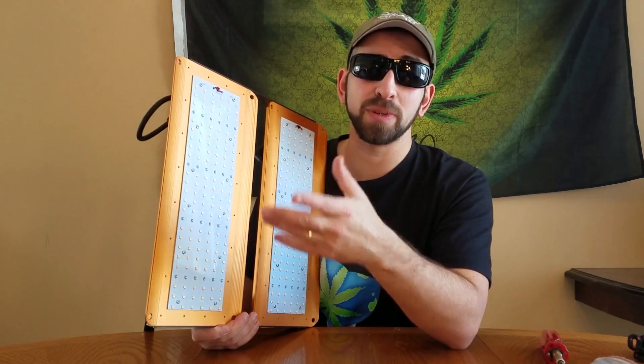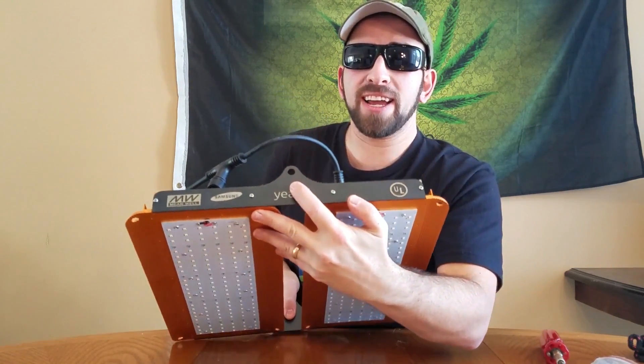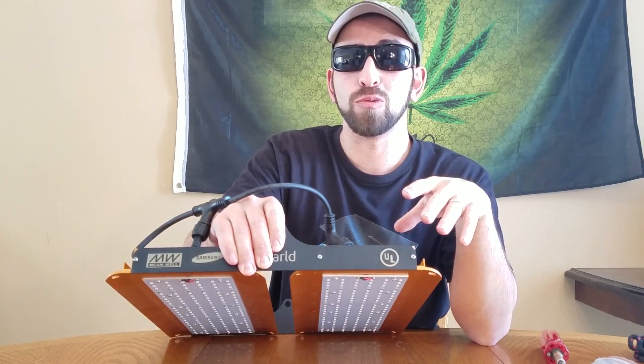This light is UL certified — they even have it right here on this bracket: UL. It's UL 8800 certified, which means it's designed for commercial grow rooms with a lot of exposure to both workers and constant humidity. UL is a certification standard run by a company that provides certifications across many varied manufacturing industries, from fire alarm makers to battery and building wire producers. When you see their certification on a grow light, it means the fixture meets certain parameters: ingress protection, photobiological standards concerned with eye stress from long exposure, certain environmental standards, and wiring and connection standards fit for the gardening environment.